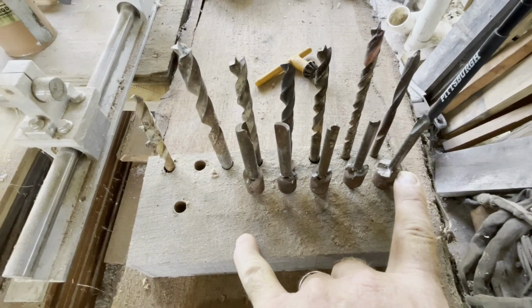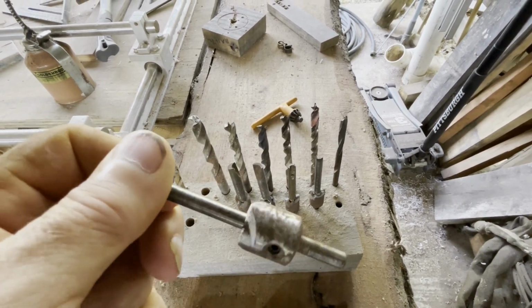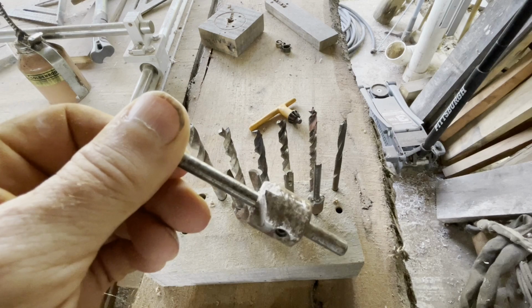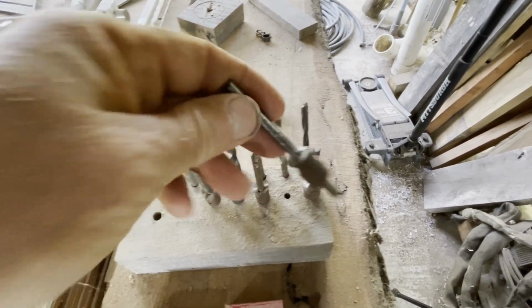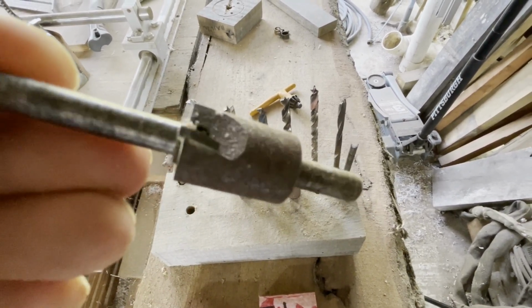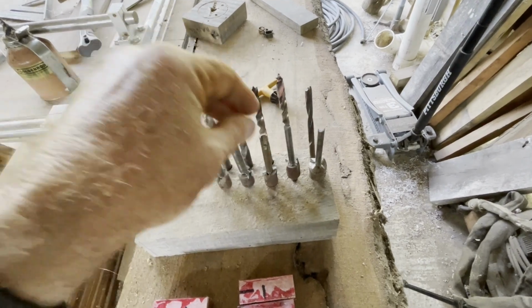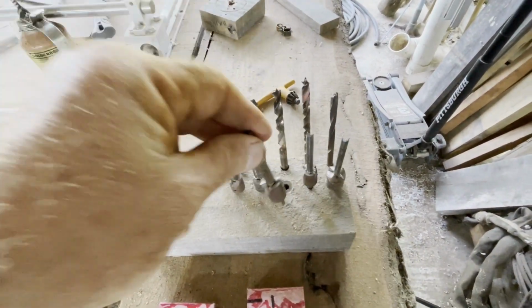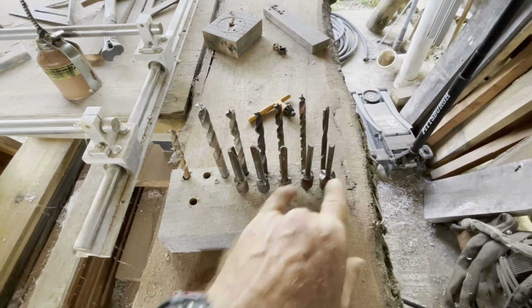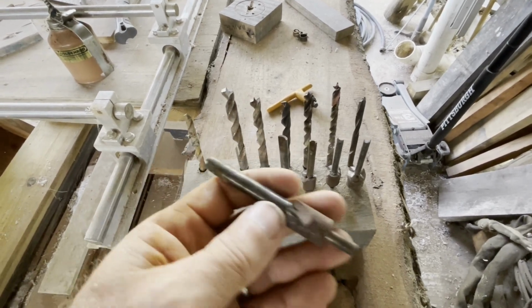And on my 8mm, I got this. Here is one that comes with your cheaper sets. It's just a regular steel trimmer, I don't even know if it's high speed steel. And then I have these carbides that I started buying because they last longer. But if you look right there, they chip on the edges. And once they chip on the edges and they get down too far, then they won't leave you a good flush trim. Now, some of these are still okay. But I try and keep one set up for your 7, 8, 3/8 and 10mm, because those are your most popular sizes.